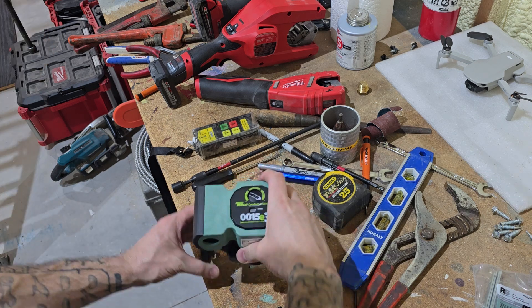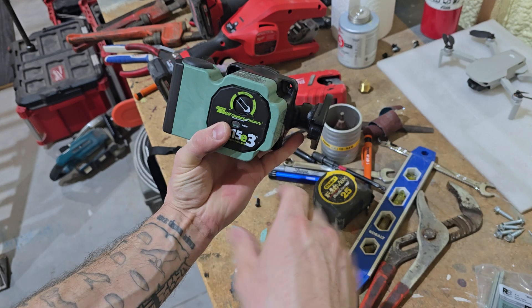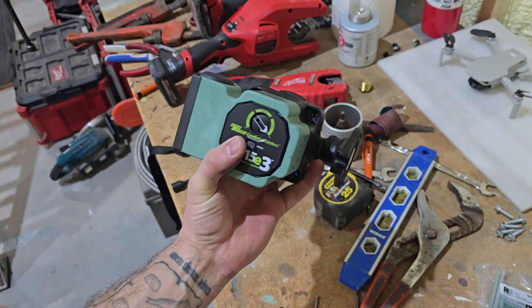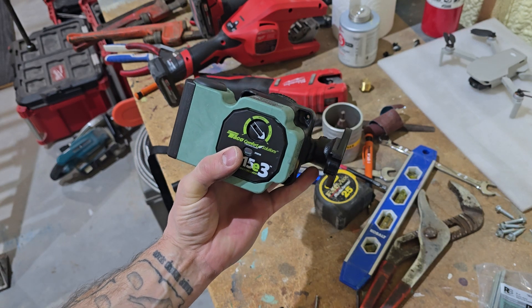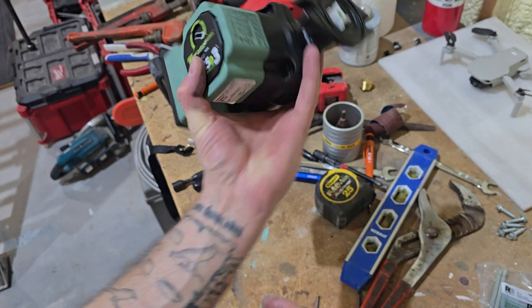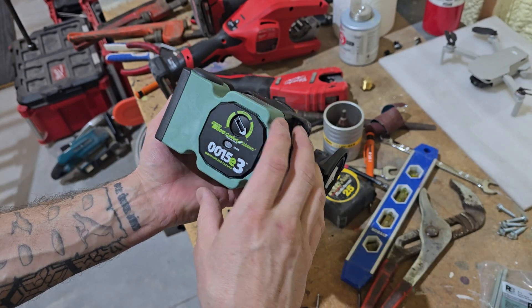Now you can see this pump is configured horizontally so that when I'm looking at it and it's mounted, all the wording's the right way, the dial's pointing the right direction, and my wiring can come either up or out of the bottom. Makes it a lot cleaner install. All the time I see pumps installed upside down — most people probably just don't realize you can do that.